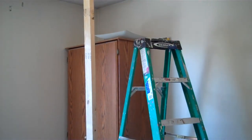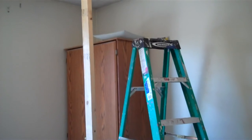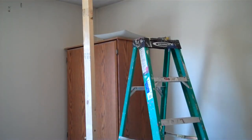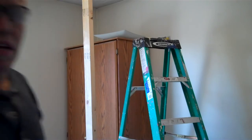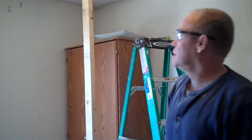This house was built in 1975. And as it slowly comes down, they're savable. You'll get drywallers, all kinds of morons in here with no expertise. They can be saved. So you jack them up piece by piece. And as you go, I'm using these washers. I'm using 16-penny nails. Boom. Then I'll plaster it back together.